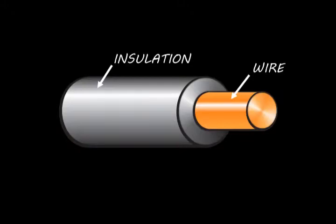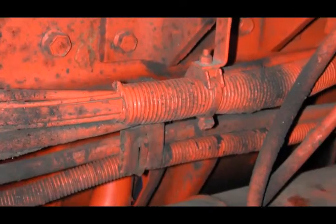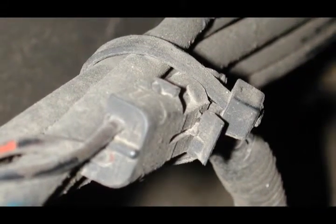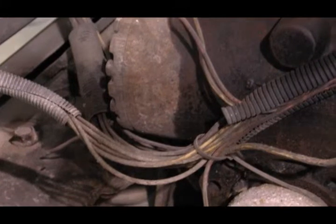Well, sure it is. But the very insulation that protects the wire from water also creates an engine that pulls water along the length of the wire, from the outside of the truck where it gets splashed and rained on, all the way to the components inside the truck, the ones that are supposed to be protected from the storm.